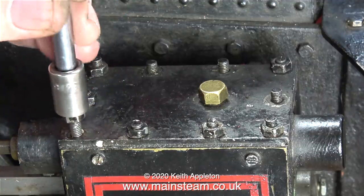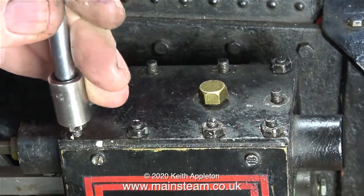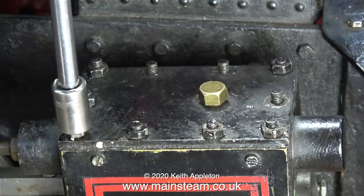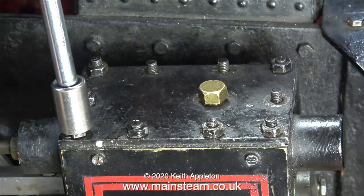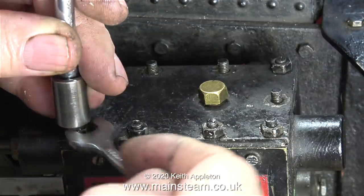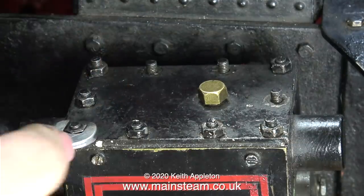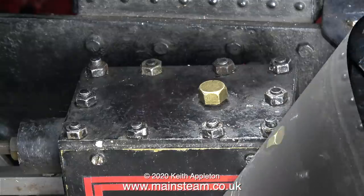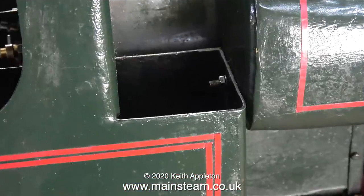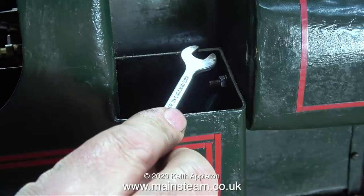Here's a close-up view of the lock nut method of installing long studs into cylinder castings. This is a far better method than using a pair of pliers on the stud. All you do is use two lock nuts locked together on the end of the stud, screw it into the hole, and when you're nearly there remove the socket and use a spanner to tighten the lower nut against the steam chest cover. After fitting the last two nuts and giving them all a final tightening with the spanner, the steam chest looks like this. The gasket was in good condition so I didn't see the need to make a new one, and this should be fine.